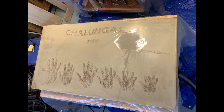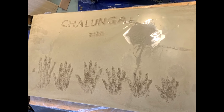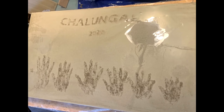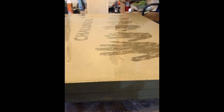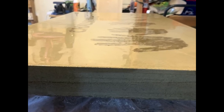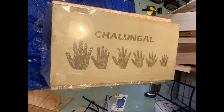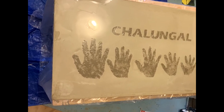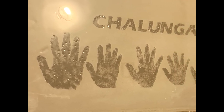The Glaze Coat product had good reviews and was easily available on Amazon so I went with this option. The application process was fairly simple following the instructions on the box, and I applied it using a plastic spreader. I also used a heat gun to lightly go over the poured epoxy to get the air bubbles out. This got rid of most of the air bubbles except over the designs, which still had some remaining. If I were to do it over again I probably would use a brush to work the epoxy into these areas before putting the top coat on — though I didn't mind it as it just adds to the character and story of the coffee table.